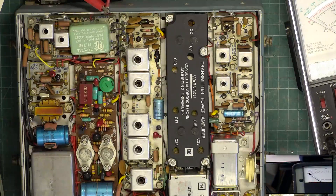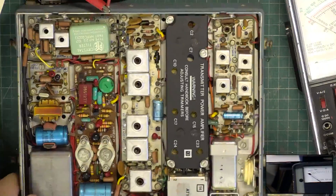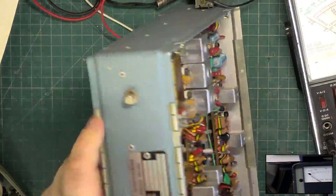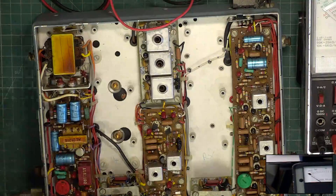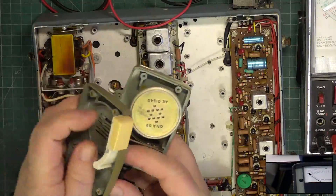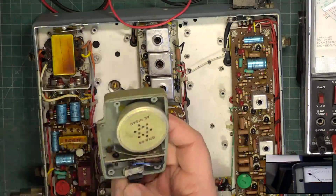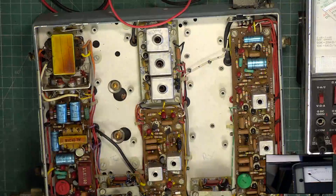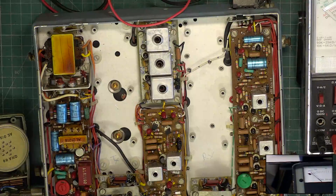I've decided to redo the rest of this video, though of course it's going to be shortened because I've already done the alignment. We'll put the radio the other way around. I had to open the mic up because the push-to-talk isn't being actuated properly by the lever. I'm going to have to put some tape on there to build it up a bit - it's so worn it's not operating the lever. I don't want to mess with the spring strength, so we'll just build it up. It's 1973, so it's probably done a few years.